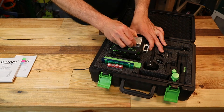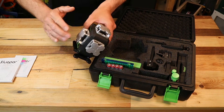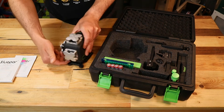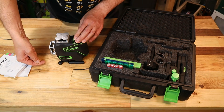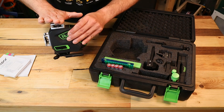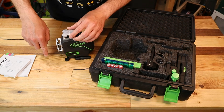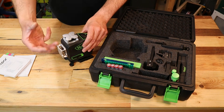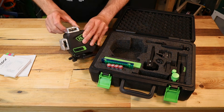The laser has four beams: two horizontal and two vertical. Why two horizontal? You have one very low at the bottom — that's useful if you want the beam very shallow above the ground. The same applies going underneath the ceiling. You can also measure from a beam, but it's not necessary with this one, and every measurement can produce a kind of error and errors will sum up. So it's not a must-have, but it is a plus.